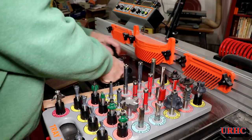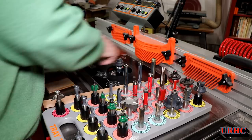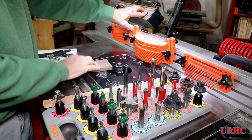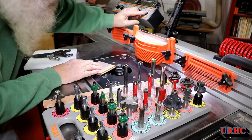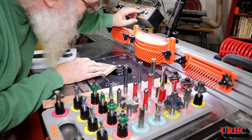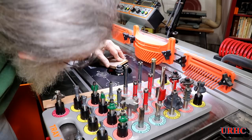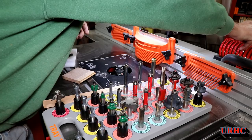Once the bit is in, I've got an old piece of tongue-and-groove that I used these cutters on before, so I'm just going to use the power adjustments to get it set perfectly. I'm not using the DROs — I just have to hit the profile right, and I've got really fine adjustment, a couple thousandths at a time, until everything comes in perfect. Then it's a matter of selecting the right ring to fit around it. I put some rare earth magnets on the back of those openings for the rings, so they now stick to the tool magnetically — makes them really easy to get in and out.